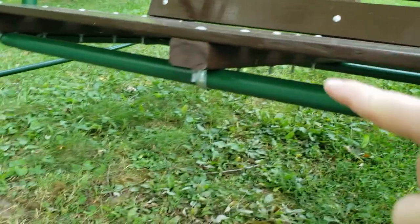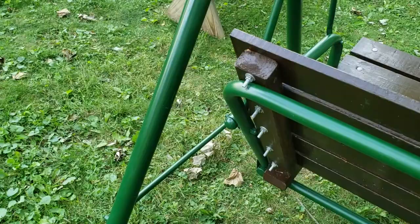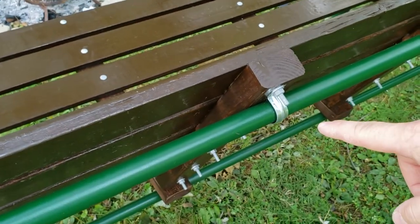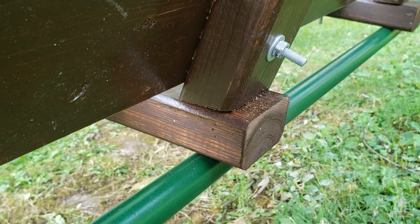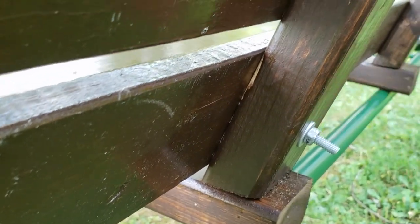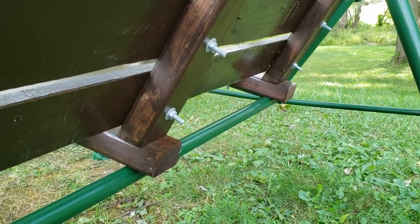So I've got it attached like that here and over there. Nothing's attached here, nothing's attached over there. And the back — nothing's attached here. I've got a smaller little clamp here and another one there. I found out the angle that I needed to cut here. And then these 2x3s are just being held in with 2 pocket screws — one on this side, one on the other side. And I have the same thing here, here, and in those two as well.